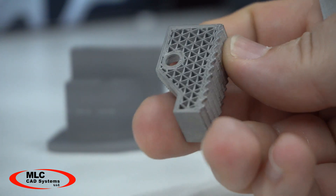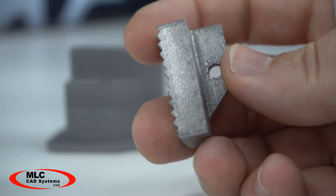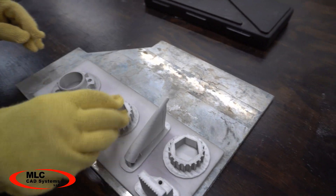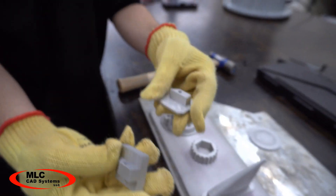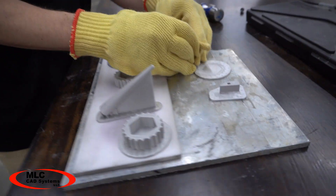These parts are incredible. They have the heft of aluminum but the strength of stainless steel. Removing the finished part from the supports is simple — the ceramic material turns to a powder in the oven, so a simple tap or even a drop on the floor will separate your finished part from the support, and it's ready to be used right away. As a last optional step, we usually tumble or deburr these parts the same way you might with a machined or cast part, assuming the surface finish is important.